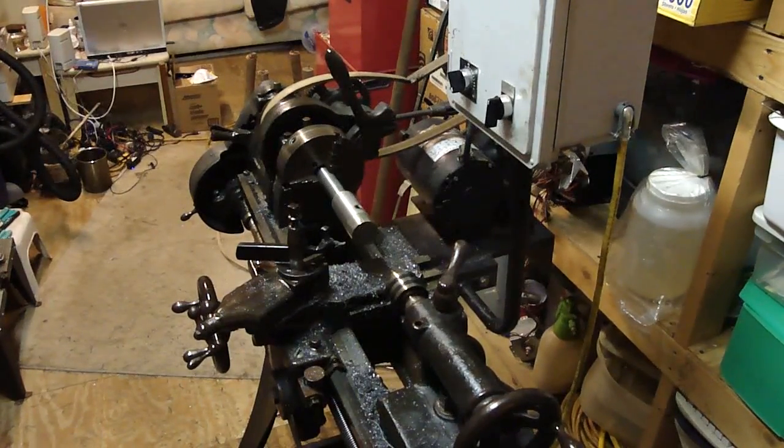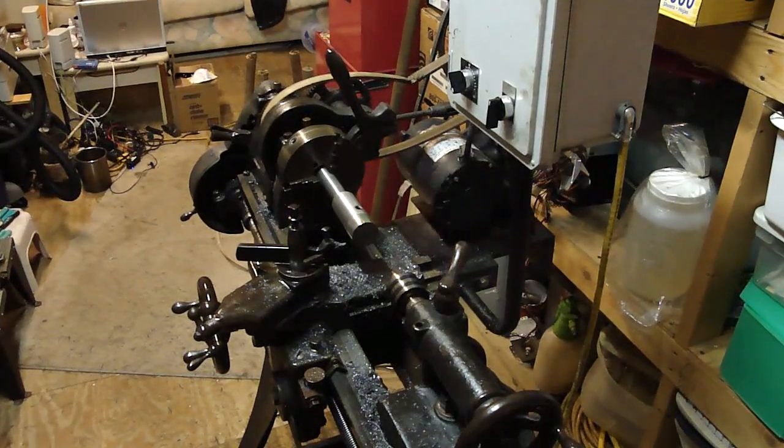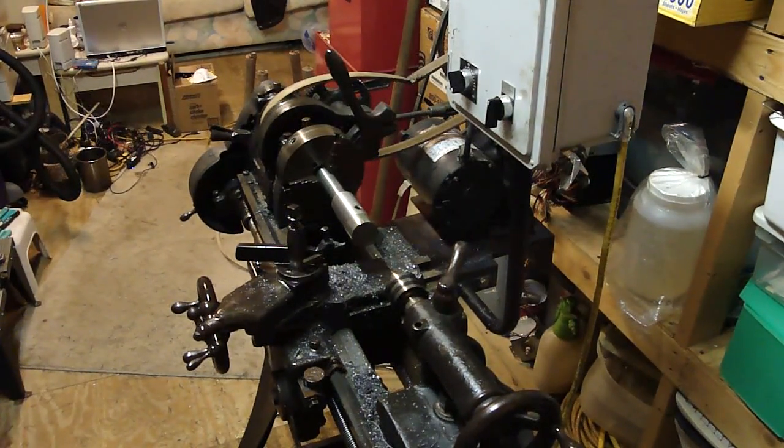I dialed that in - I thought my battery was dead; it did quit right when I pulled the indicator up. I had a time of it. Don't try to dial something in if you've got something wedged between the jaws like that - it's difficult, especially if they're of different thicknesses. They better be shim stock of the same thickness on a three-jaw chuck, because it's trying to automatically center the thing and it'll run out. So I took the shims out - I'll be cutting through that anyhow, so it's no big deal.